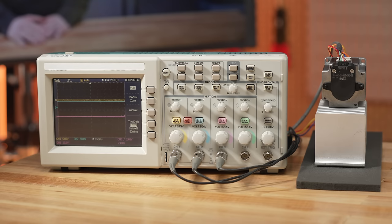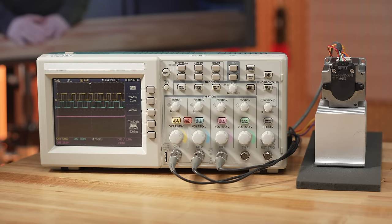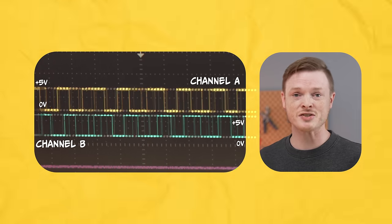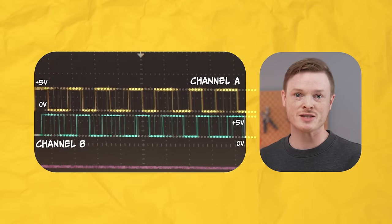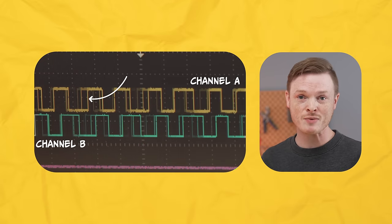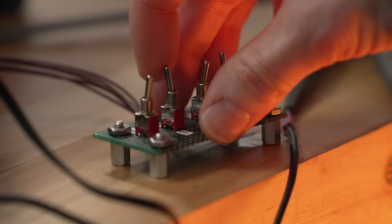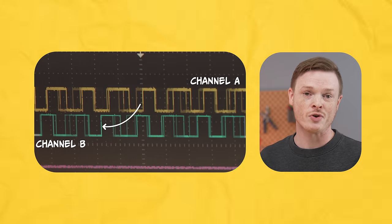The sensors are aligned in such a way that channel B is offset a quarter of an electrical cycle from channel A. Notice in this case, channel A goes up to 5 volts first, then channel B follows shortly after. We can tell the direction of motion based on which channel goes to 5 volts first. In this case, if A rises before B, we know the disc is spinning in a clockwise rotation. If we switch the rotation to counterclockwise, we can see that now B goes high before A.